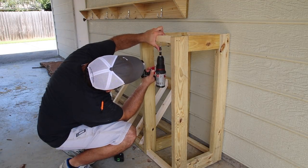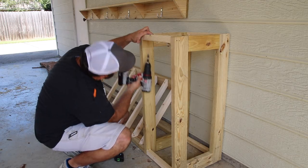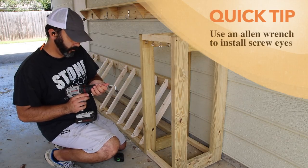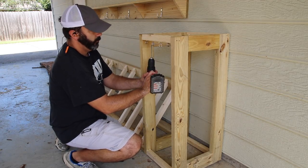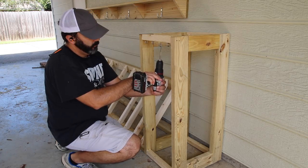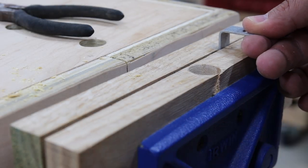On the ball bin we're going to add some bungee cords, so I'm going to put some screw eyes in — I call them eye screws, the package says screw eyes. Either way, these are screws with an eye on the end to where you can hook something to it. Quick tip: use an Allen wrench to install your screw eyes. I grabbed an Allen wrench, chucked it up into my drill, and once I've got those things started I can just stick that Allen wrench in and it just drives it in — because I've got to do 12 of these things and my fingers would be really tired. That's a pretty good quick tip.